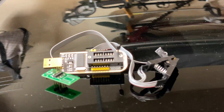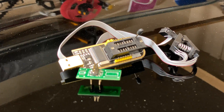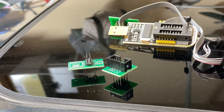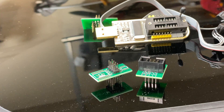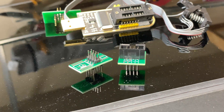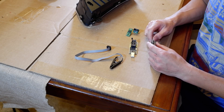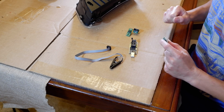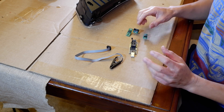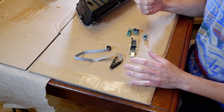This thing programs all 25 and 24 series EEPROMs. They also come with two or three adapters that allow you to program some other chips. The problem is most of this is geared towards 3.3 volts and motherboard-type BIOS. In the automotive environment, you actually have to use 5 volts to write to these EEPROMs. I learned this from Dr. Shock's YouTube channel - he has a pretty good tutorial on how to modify this and I'll link it in the description box.